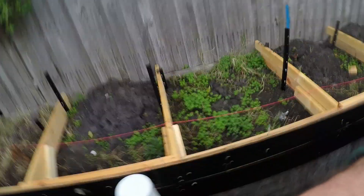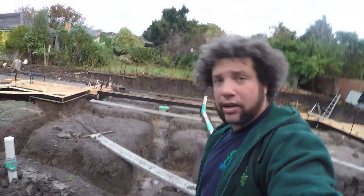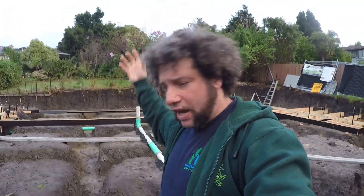It creates an area for the house itself to breathe. What's vital to this process is ensuring we've got all of our things in the correct places. You'll see I've got nails wherever we need them for plumbing areas, and I've run extra string lines where needed. That'll also help me find on the inside of our slab where we're putting load-bearing points. Here you can see the massive hole — that's actually a mass concrete pad. That's the junction point for a whole heap of our steel beams that come together, and it goes directly down into this area so the weight spreads over an area rather than coming down into one place, ensuring structural integrity through the whole build. Don't forget those steel beams will be holding up the next floor.